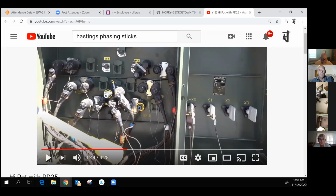And these actually bleed off static off of the dead end receptacle here if it's not on. When I first went to work with the utilities, we actually had to go up to Camden outside of Lugoff, that area, and install these little wires back into the backside where the elbows are. They have them here on the elbows because the contractors went up there and put these transformers in and did not connect this up, and you could really hear it buzzing pretty loud. So we had to go in there and ground these static points on these elbows.